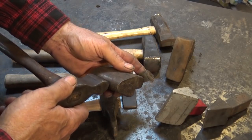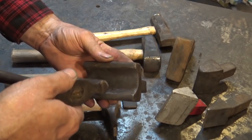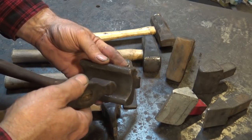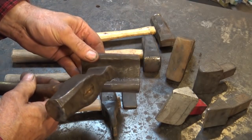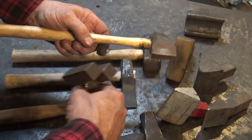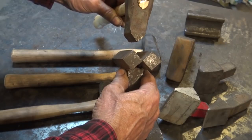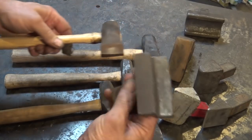Typically this is how you would use a set of fullers, but that doesn't mean it's the only way. Sometimes they are used in conjunction with a swedge to forge something down into the swedge to create a half-round profile, like a cap rail for a set of stair rails or a banister. The same holds true for a V-shaped fuller and a V-shaped swedge — if you are making V-bit tongs, this is an ideal way to forge that shape, putting the flat jaw tong in there and forging the V-bit in very nicely because you have a matching set of tools: one a fuller and one a swedge.